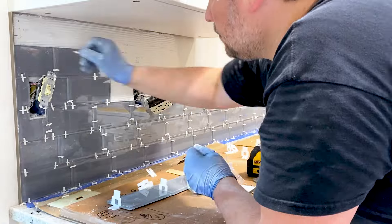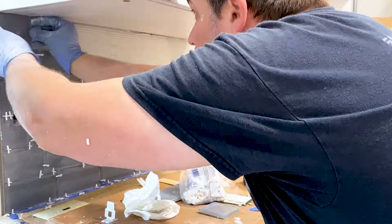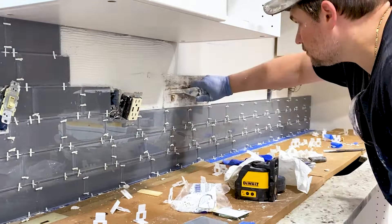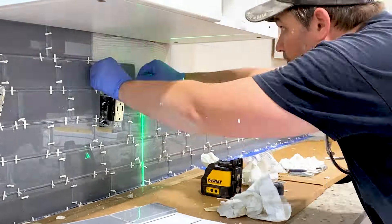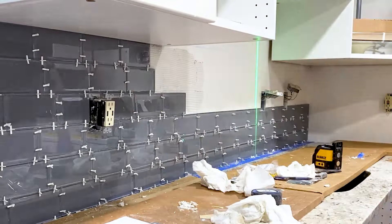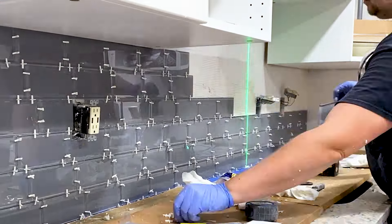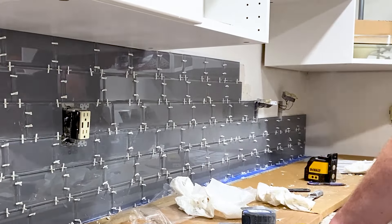Getting past all the switches and outlets gave me a boost of confidence, so we started to lay tiles simultaneously a few rows at a time, which made things go a little bit faster. It was getting late, and living in a condo, we could not in good conscience run the tile saw at this time of night, which gave us a good natural stopping point for the day. After cleaning the excess thinset around the last tile, we went back and double-checked all the grout lines, making sure they were mud-free and removed the painter's tape under the first row of tiles to ensure a nice clean grout line at the counter. As we removed the tape, we reinserted all the spacers to prevent the tile from shifting.